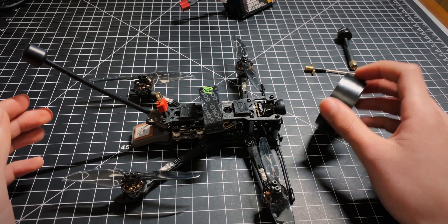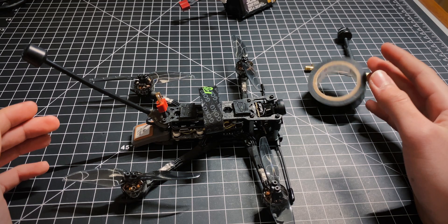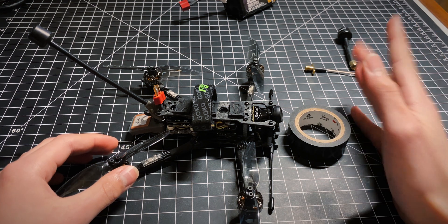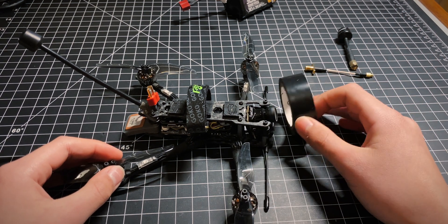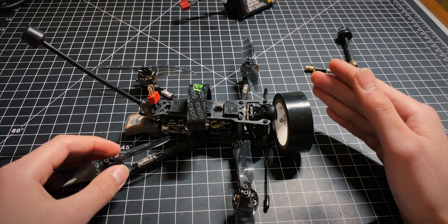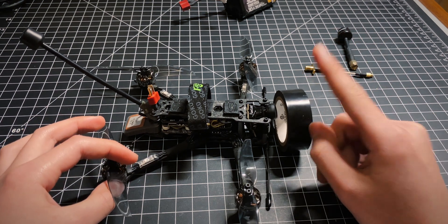Next, get a reliable brand VTX. A lot of cheap VTXs will advertise putting out 800 milliwatts and only put out 600 milliwatts. Not all cheap VTXs do this, but many of them do. Also, make sure your VTX has access to enough airflow and/or a heatsink. Basically, VTXs as they get hotter will decrease their output power without you telling them to, just so they don't overheat. If they aren't overheating, they won't do that and you'll get more range.